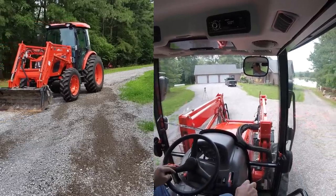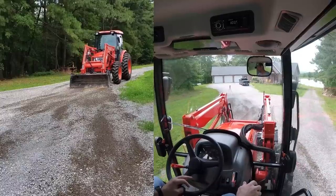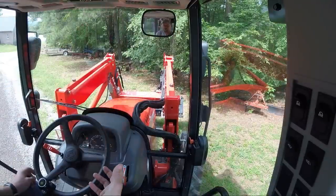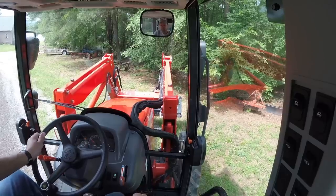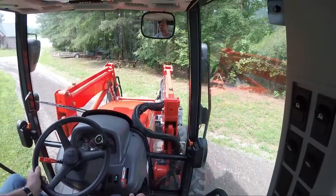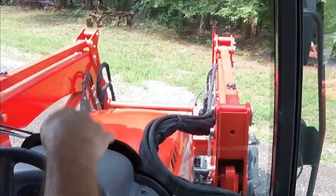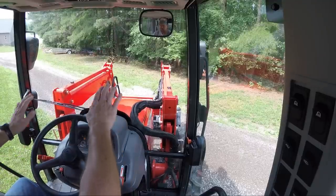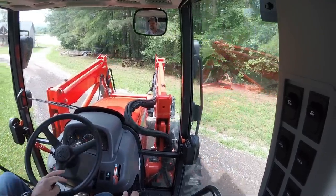Running this in float mode — I can see I'm pulling gravel up, and that's exactly what I want to fill in some of these ruts. This is another example where float mode comes in handy: I've got gravel that washed out into the grass. If you put too much downward pressure with the hydraulics you could pull up the grass, but in float mode it's just gravity, so you have a much better chance of pulling the gravel with very little grass.